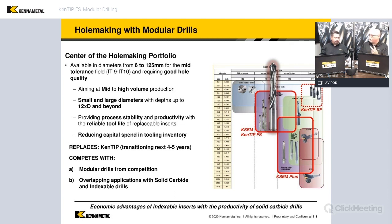So you may have a two-fluted indexable drill, but when you start calculating your speeds and feeds — especially your feeds — you need to calculate your feed on the effective cutting edges. A modular drill is going to give you two effective cutting edges, just like a typical two-flute drill, whereas an indexable would be a lot of times just one cutting edge.